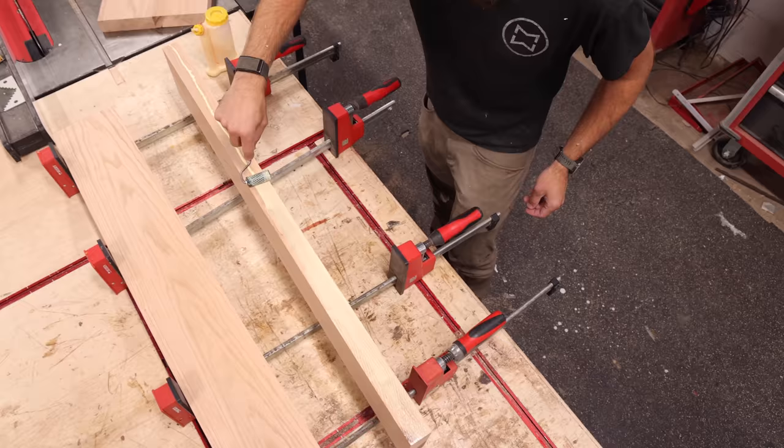It's seated. I'm torn on what I want to do — originally I had just two legs at an angle that I was gonna taper, which I think would still look pretty good. I like having minimum points of contact where the floor is, because if the floor's out of whack the table doesn't sit well. But a coffee table sits on a rug, so maybe something else could work. I made a little template of something I wanted to look at. When building an organic piece like this, I highly suggest it. Because this has a crotch in it, I kind of like this double-leg vibe — but I need to mortise them in, which we don't normally do, so we'll figure this out as we go.